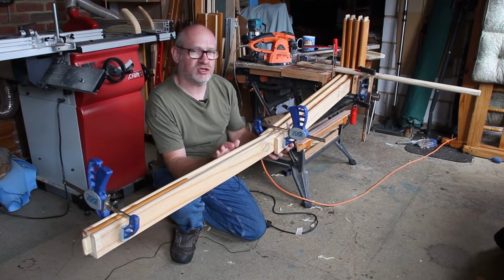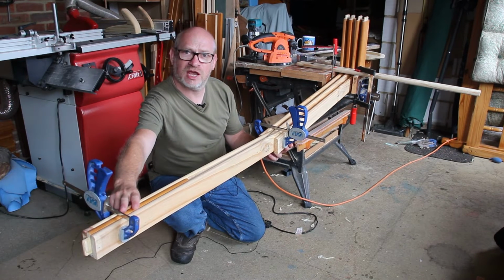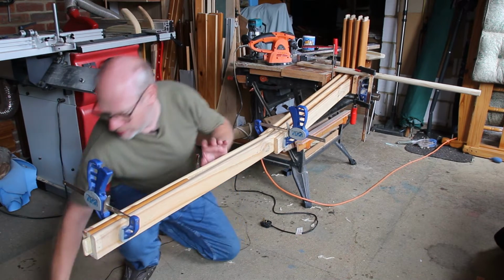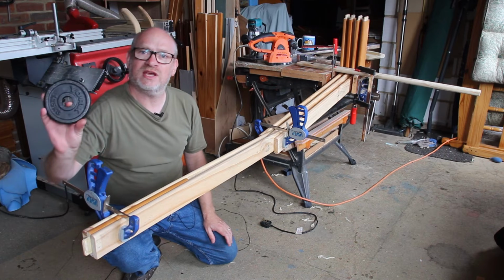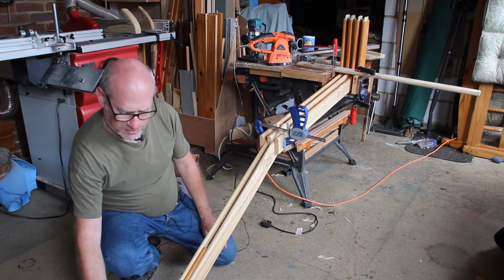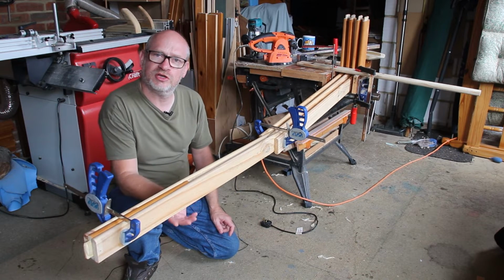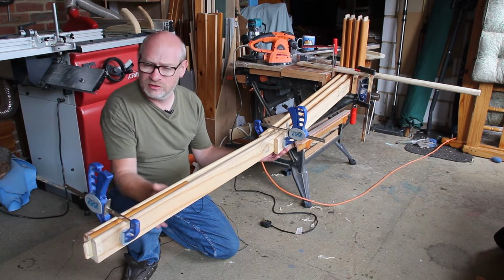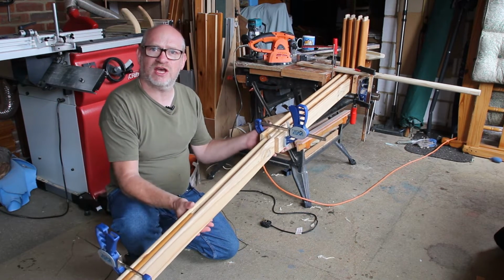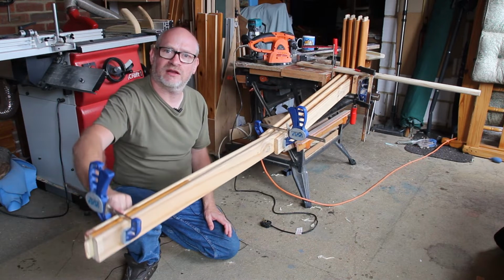The key thing that I need to control and test is I need to be able to put about 2 kilograms of weight on the end. At the moment I can't even put a little bit of weight on. This here is 1¼ kilograms, and you can see it can't hold it. So I need to find a solution that will allow me to hold weight without the arm then moving. At the moment it holds itself, but it doesn't hold any weight at all. Even a little finger can move it.